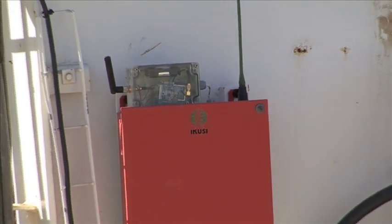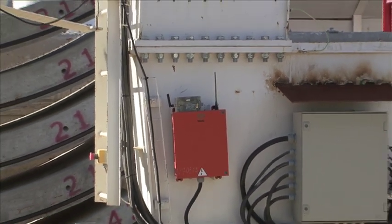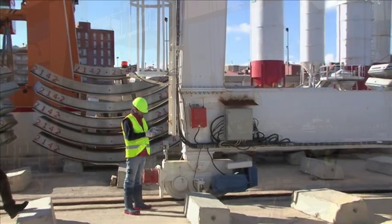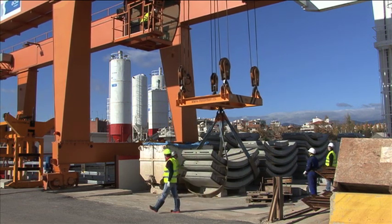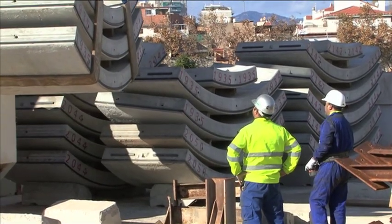At the same time, the GPS sensors provide information about the location of each item, allowing the automated management of the storage that will optimize it using diverse location algorithms. This allows the remote control, even the fully automated control, of the cranes without needing an operator personally moving close to each piece to ensure its correct placement.